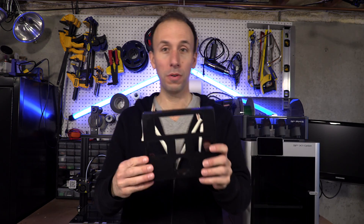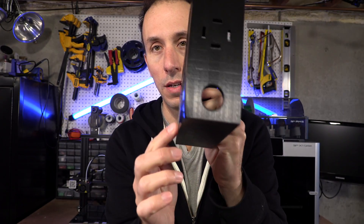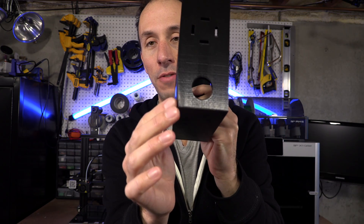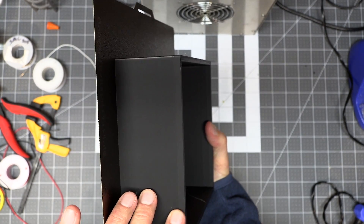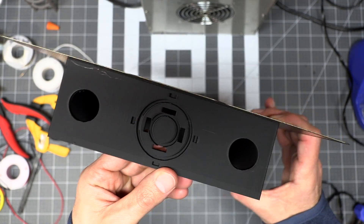Here are a couple reasons why I upgraded from the Ender 3 Pro to the X1 Carbon. I really needed something with auto bed leveling — the Ender 3 Pro does not have that. I was getting great prints in a 3x3 or 4x4 area but once you got to the edges the bed warped. On the Ender 3 Pro you can see the corner curves up and circles turn into ovals. The same file printed on the X1 Carbon from Bambu Labs came out so much better — everything is straight, squared, and the holes are circles, not ovals. Very satisfied with this print.